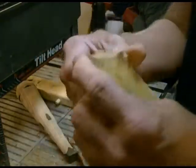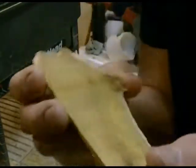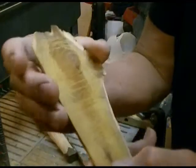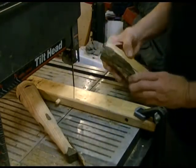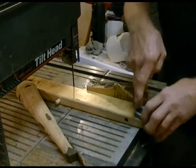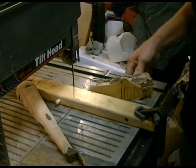What's happening in there is the grain is trying to make my blade wander and it goes offline, but hopefully you can get some idea of the beauty of the grain in that piece of wood. It is gorgeous. I need to get over three-quarters of an inch and then over three-quarters of an inch. So now we're going to readjust our fence to three-quarters of an inch. For all you out there in centimeter land — three-quarters of an inch is 19 millimeters; 20 millimeters would be close enough.